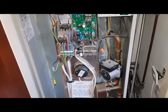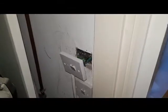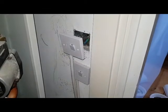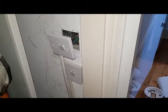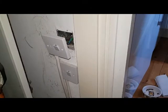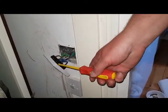The first thing we found is that when the unit is turned on by these spur switches here, what happens when you turn it on is it actually turns it off. So it's wired incorrectly — the customer has been turning it on thinking it's working, but it goes off. The other thing we found is the wiring behind the switch is also incorrect, which we're going to show you.